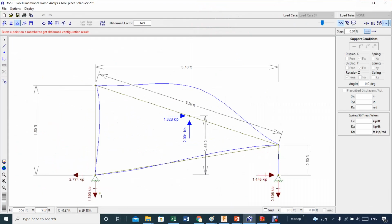For example, I'm showing you here, you can have this type of anchor with bolts, or it's going to be rock solid. When you have rock solid, there's a lot of moment developed that you have to worry about as well. But if you put this brace in your design, it will reduce the forces that you have to deal with. So you need to brace your anchoring system to avoid bending, which is the bad part.